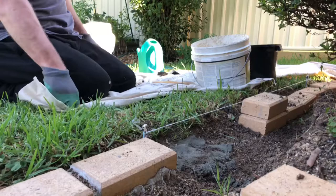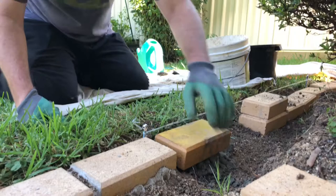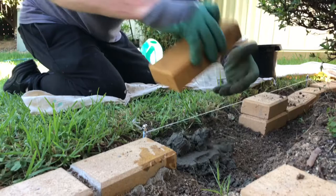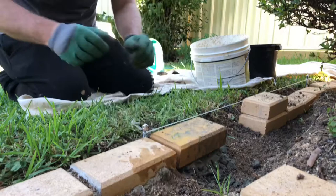I'm placing the mortar down nice and tight, packed down but not too much. I do a run of mortar across in the direction the pavers will go — a loose mountain sort of shape. All I want to do now is get the right height and direction. I don't actually glue them in place at the moment; I just want to get the look right and fill in mortar between them later. The first paver is always the hardest — it's like your keystone. Once that one's done, the rest follow from that.